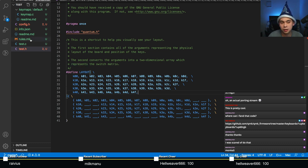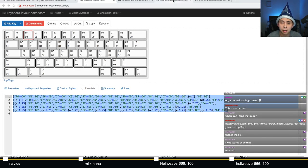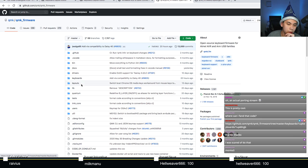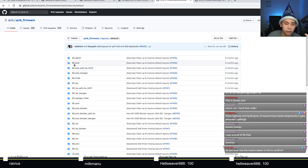At this point, the next step is to actually put in your key map. So I'm pretty lazy. I don't like to do my key map by hand. So I like to go into QMK and borrow what's already there. Let's borrow a 60% keyboard's key map by going into layouts, default, let's do 60 ANSI,